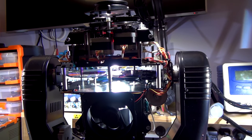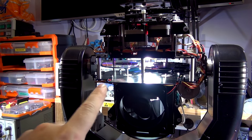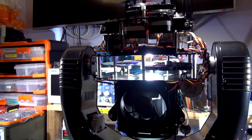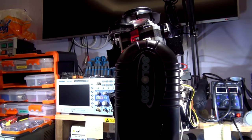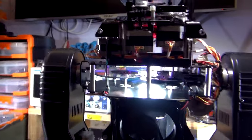So it is exactly like the other one except it's a cheaper version with fewer functions and I guess less reliability for critical events like a big stage production — because this light doesn't know its positions, it's guessing based on the homing it's done. For example right now it thinks it's straight, but if I pan it you can see it's not exactly straight. So technically it should be spinning around itself but it's slightly off, and the light doesn't know that. If I home it again it should be dead center, but it is not — it's slightly off.